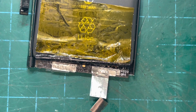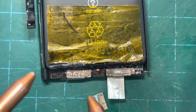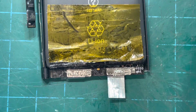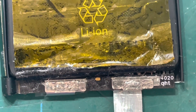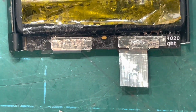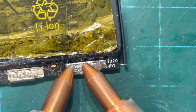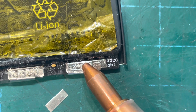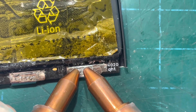I'm going to go to number eight just to make sure — it's only a little bit warm. Yeah, that's got it. I'm going to place this little bit on top of the aluminium and get that one welded as well. I've placed this — the other half of that piece — on top, and they should now nicely weld.